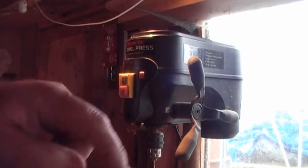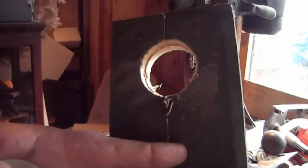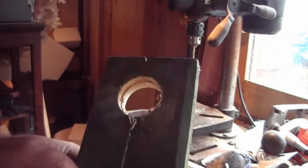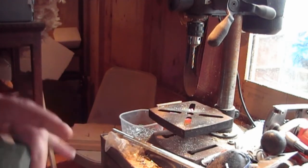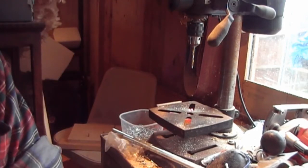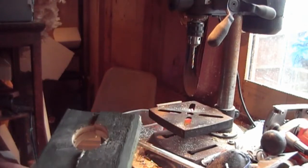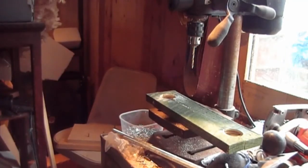I'm going to take this to my circular saw and put a slot in it. What I did is put a saw cut down here - I tried the screw in it and it didn't want to know; there was just too much pressure to pull it tight together. So I split them in half, which is much easier. Now when I put the screw in it will clamp really tight on the plastic pipe and doesn't move. I'll still go through each pipe with the screw, and I might put an extra screw in the center to hold the two together as well.